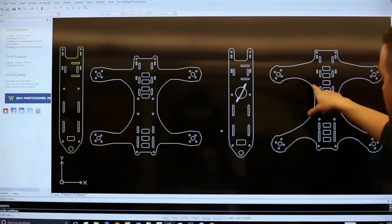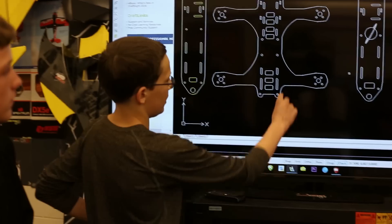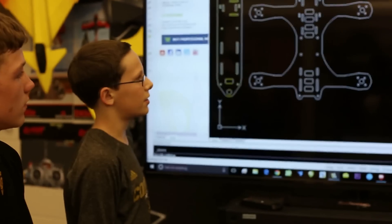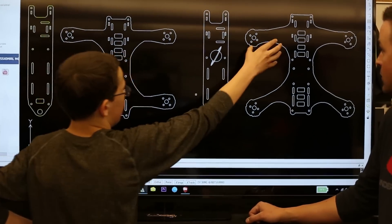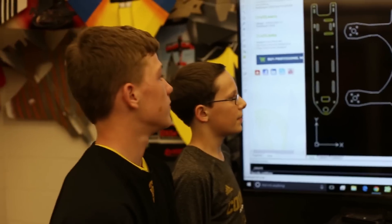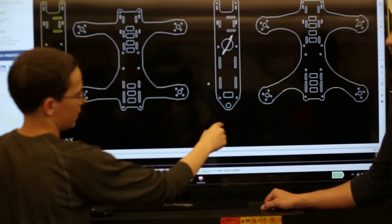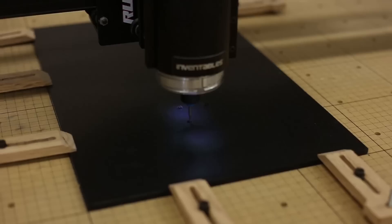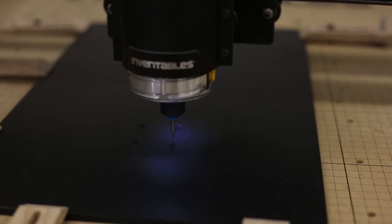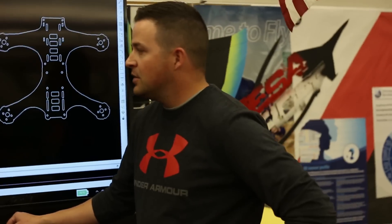Tell me why you started doing these crazy corners. Originally, both Trenton and I had very skinny arms, and that's what broke when taking it out of the CNC router. So we went back and really widened them up and made the bases really large, so the smallest point is still pretty thick and they don't snap as easy. We also had to make it a lot wider because the holes and lines were on top of each other. The router we're using is the Inventables X-Carve, and the bit was a lot bigger than we thought — we're using a 1/32-inch bit and it cuts on the outside of the line.